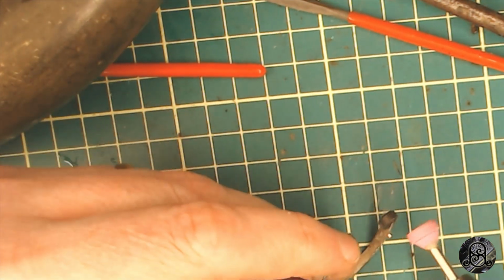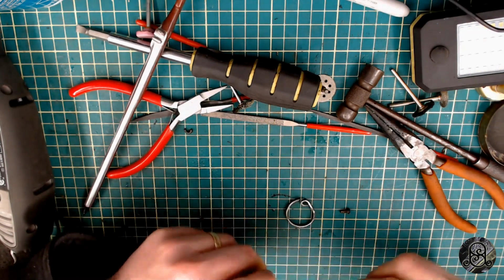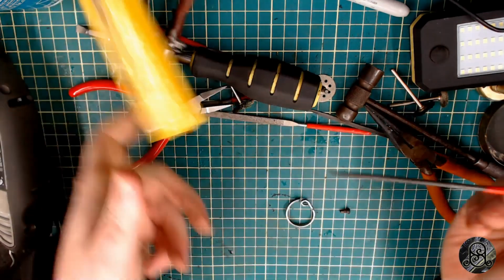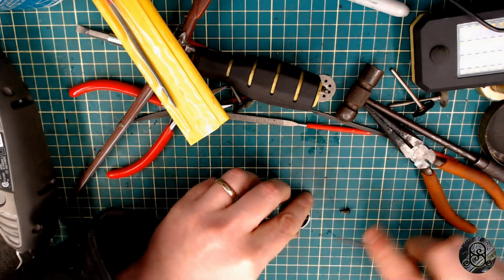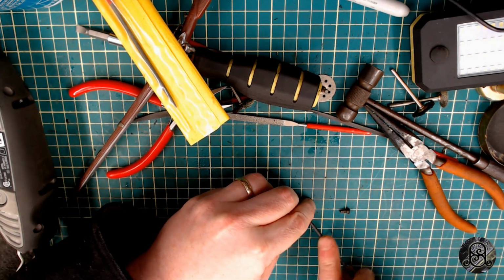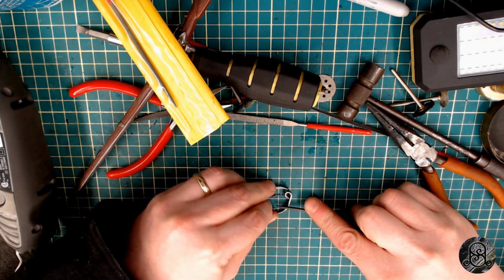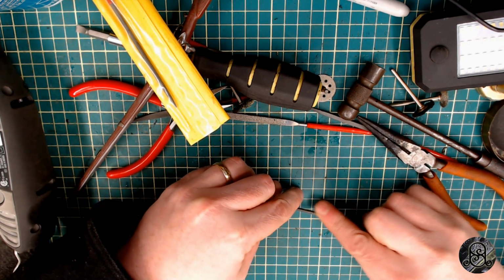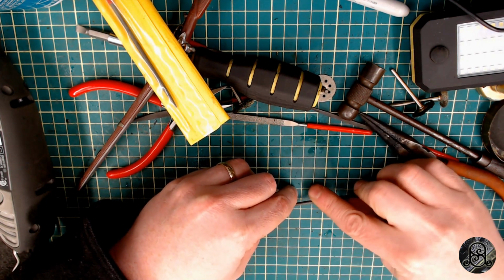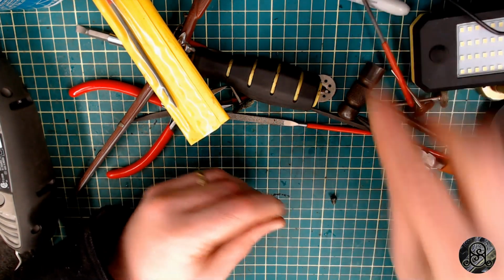So back to more grinding. So no more rough, sharp parts there. I'm just going to grab a very fine round file. Perfectly round. I'm just going to go into where that little peg is with the tip rounded out. Anytime you have a 90 degree angle, a really sharp angle, you stand a good chance of breaking that piece of metal there. Now this is not a very long piece, so hopefully it won't get too much torsion on it, but safer than sorry.